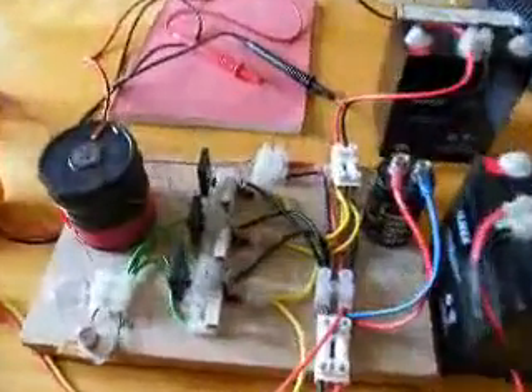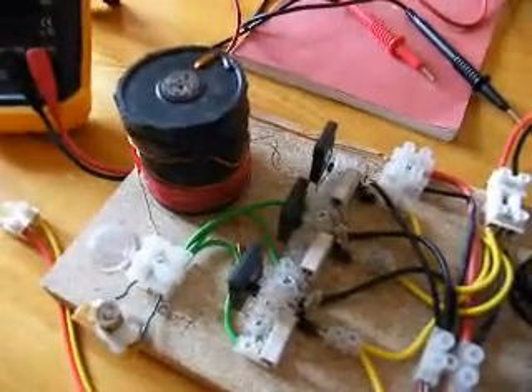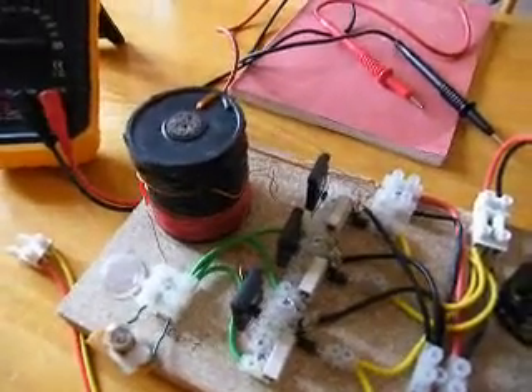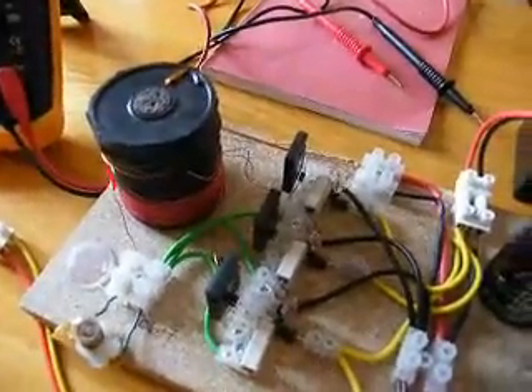This is a standard SSG circuit. It's a seven-strand coil: one trigger and six power strands which are connected in series, Tesla fashion. So I've got three transistors.